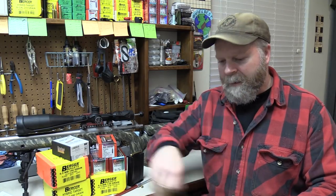At the same time, it puts a perfectly flat seating surface for the primer down at the bottom of that pocket. But if I run over this Lapua brass, there's hardly any action at all — it's just barely swiping right at the flash hole. So with Lapua brass, I don't worry about it, but I use it to clean the pockets out. It just cuts carbon right out and you see shiny brass, because you will get some brass flow back into that pocket after you fire the cases a little bit.